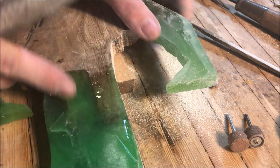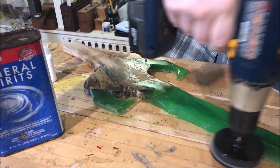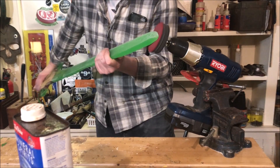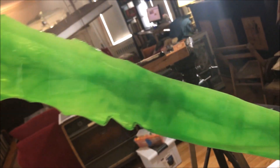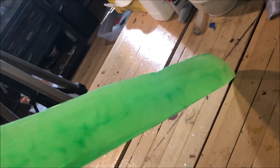I used files to make gem-like facets in the epoxy. And I didn't have a plastic polishing kit or plastic polish, so I went to the auto zone and got headlight polishing kits. Man, did they polish this thing smooth — really, really nicely smooth, but not very clear. This is what it looked like afterwards, and it looks pretty sweet, doesn't it? Well, that's because it's backlit and we'll get to that later.